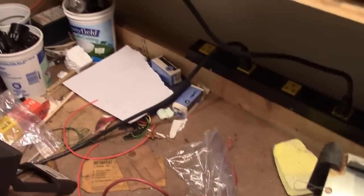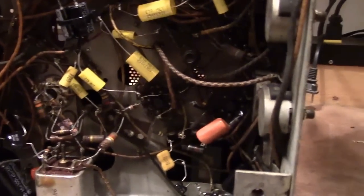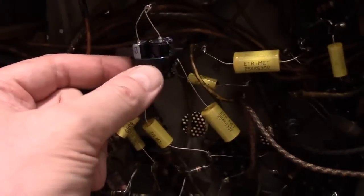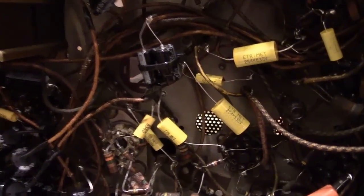Oh, he also replaced the anode lead, which is nice. I don't recall if he posted about this on video camera or not. He was moving, and I can fully understand wanting to lighten the load before he moved out west. But it looks like he did a pretty complete job under here of replacing all the paper caps, and here's the electrolytics. Like, here's the one I took out, and here's the two caps. So certainly a fine technique.